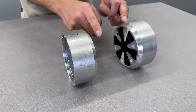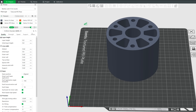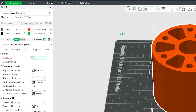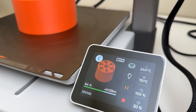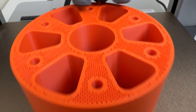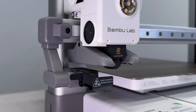To connect the two parts with some space in between, I jumped into Fusion 360 and designed a simple but strong spacer. Then I dropped it into Bambu Studio and tweaked the settings. For strength I chose PETG filament, bumped the perimeter count, and set the infill to a solid 50%. A few clicks later, my BambuLab A1 printer got the job over Wi-Fi and started printing. I've had this printer for almost a year now and honestly, it is ridiculously easy to get high-quality prints without messing with calibrations, bed leveling, or extrusion flow — it takes care of all of that for you.